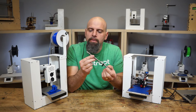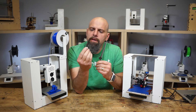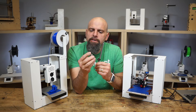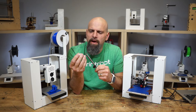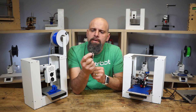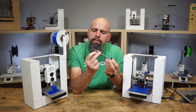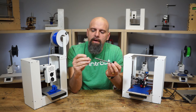Like the new Simple, we've turned down the end of this, so we're including this little Z-coupler that's actually straight through. I believe it's five millimeters — the same size as the NEMA 17 motor. So the end of this is going to be the same size as the motor, and it does have a flat on it, so it's a D motor shaft style.